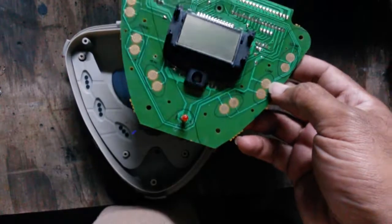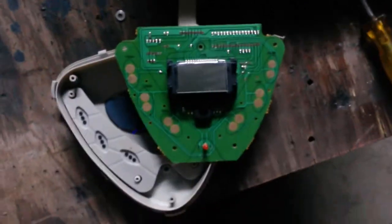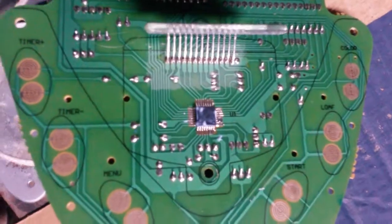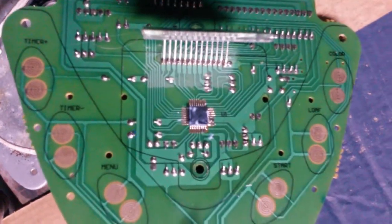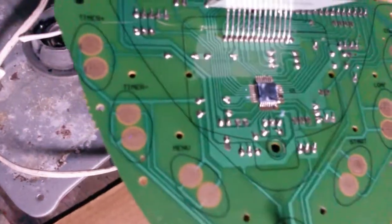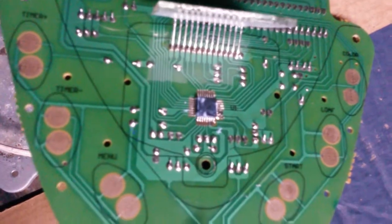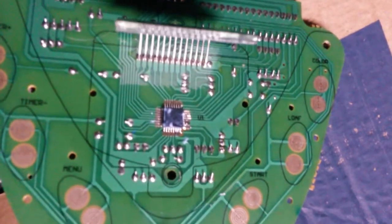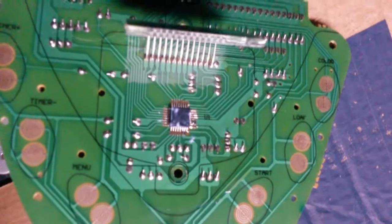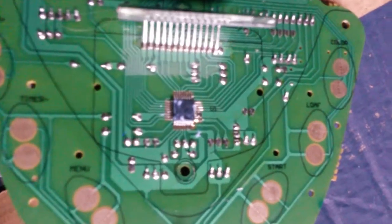It looks gold-plated — not very well gold-plated but it does look like it isn't straight copper, so that's not too bad. I'll pop this off and see what's below — chances are it's a chip-on-board, but I stand corrected — it is in fact a proper package. The conformal coating was difficult to get past. I've taken that off with acetone, and normally I just put a little bit of antacid — a white substance — let it dry and wipe it off, and the numbers on the chip become a lot more visible.